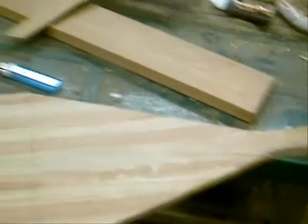Okay, as you can see, I've got a nice, pleasing shape, or at least to me, of this paddle blade. Now, I will use the stationary bench sander and clean up these corners, these edges that I've rounded off. Then, using the bench sander, I'll add a slight radius here and up in this corner here.